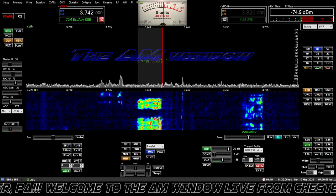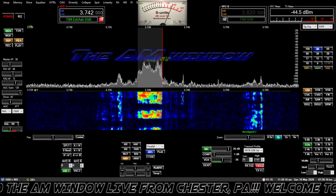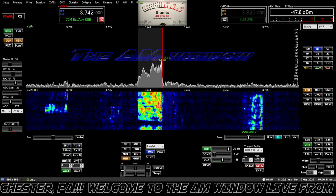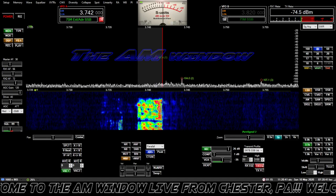He's like, that's going to cost blah, blah, blah. I have my whole station on a dropout relay box that I built. If I lose power, I have to manually put the power back to my ham station, even though the power comes back on from the utility. I control whether it comes back on. And I'll tell you, if I had a generator or an automatic switch, I wouldn't want that generator to throw that voltage to my radios while they were still on. No doubt.